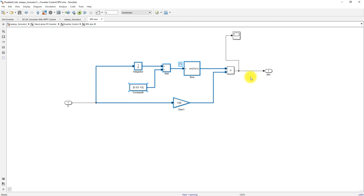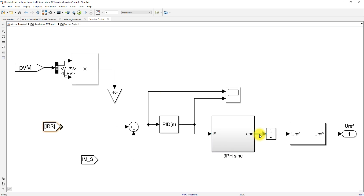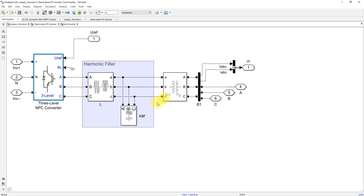Based on the frequency from the PID controller, a three-phase sinusoidal waveform is generated — this implements the V/F control concept. The three-phase sinusoidal waveform is processed via a modulating block, which generates the control voltage for the neutral point clamp inverter, supplying power to the induction machine.